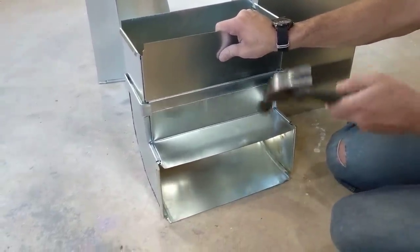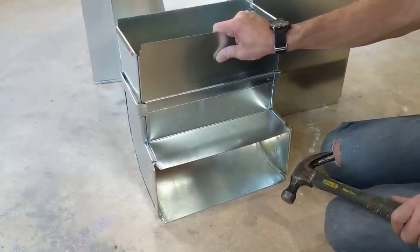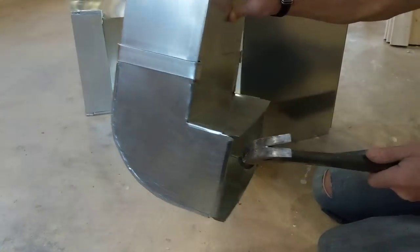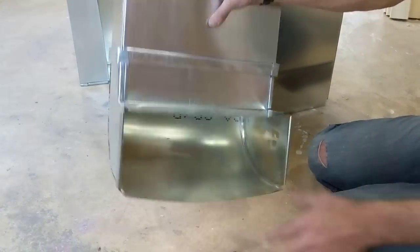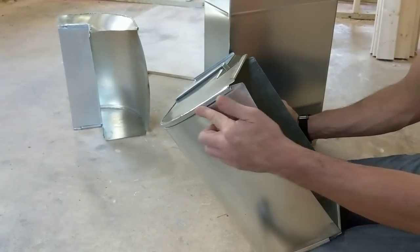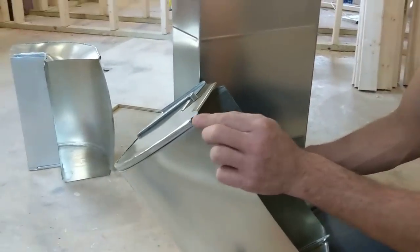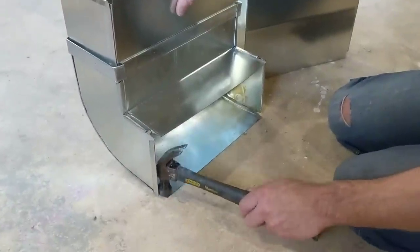Here what we're doing is we're assembling two pieces of rectangular duct. In some of the other videos I showed how to cut and assemble the ducts. This is a 90-degree elbow — I've already assembled this piece. Now I've got to put something on here. This is an elbow and the elbow corner is formed with this little joint and it's got a little offset right here.